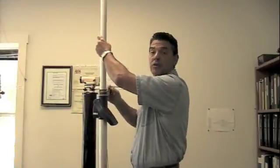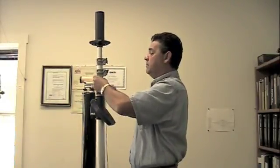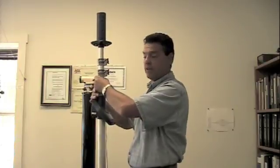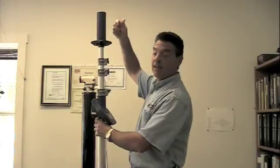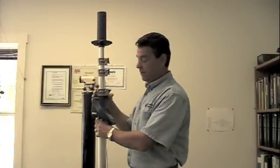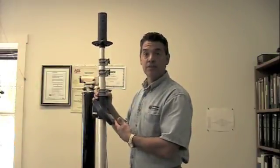You can also measure inverts with this. If you have heavy machinery trying to cross a road and there are power lines, branches, or anything above you, you can simply slide the Smart Rod up to that level, get your reading, and determine the height clearance. Knowing the height of your machine, you'll know whether it's safe to pass under.